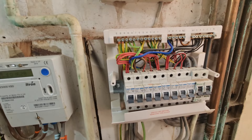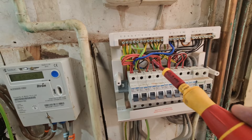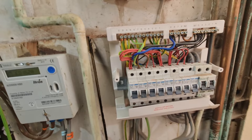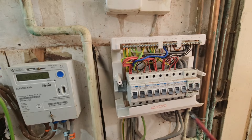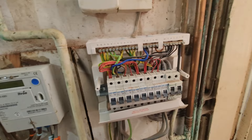We do have our final circuits - the conductors are all in the right places that we would expect. These two that were saying nothing or spare actually have conductors in them - blue and brown, so that's a more recent addition. Looking at the cable that drops off under the floor, it looks like an older style cable. You wouldn't notice any difference between the existing red-and-black wiring and this blue-and-brown cable from the outside, so it's important during your EICRs to actually open stuff up and have a look. This cable looks to drop down and go outside through an air brick - probably going off to the garage across the driveway or to an external socket.